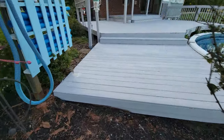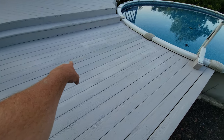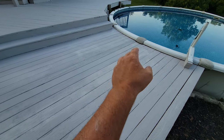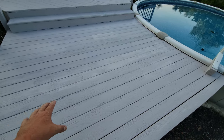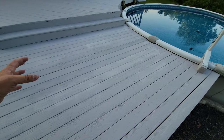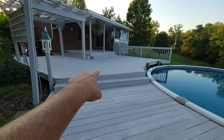High-stretch Kong armor encapsulation here. You can see the Silverback epoxy that we got laid out in this gap — there was a large gap there. The board's still good, it just has a little notch out of it about that thick, so we came in with the Silverback. This area had the Restore 10x, and we got rough with this when we washed it to get a lot of that Restore 10x up. But the encapsulation is bringing it back and saving them from replacement. This all finishes smooth and pretty — a thick build.